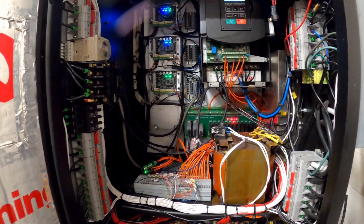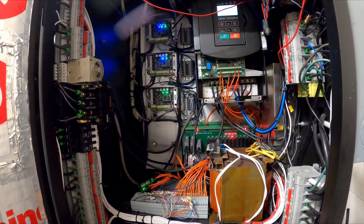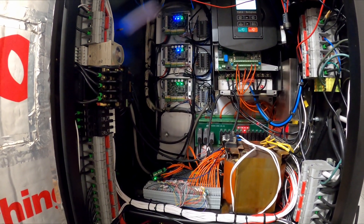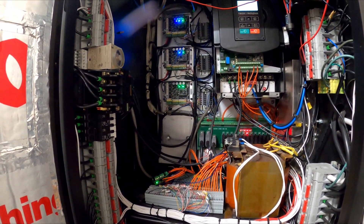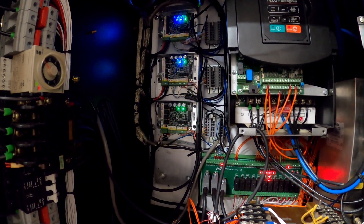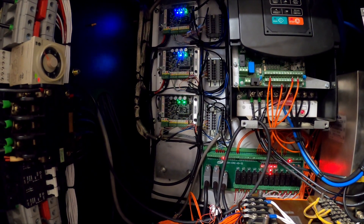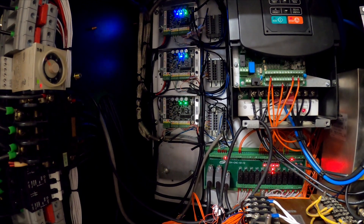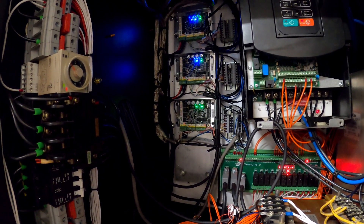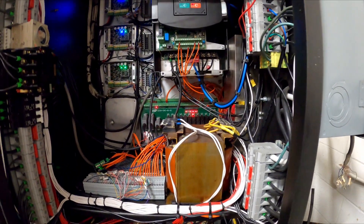The lead screws on this machine are really coarse, so you really need plenty of current. So really this machine isn't great for roughing — it does many other things, but roughing and big passes it's terrible. So in the future I'll either replace the motors for AC servos, or maybe even just change out the ball screws for finer pitch ones. The Z-axis ball screw is really worn on this machine, so that's probably the main option.